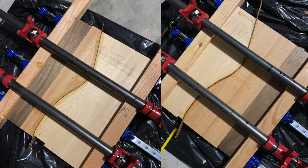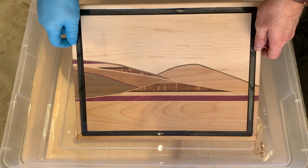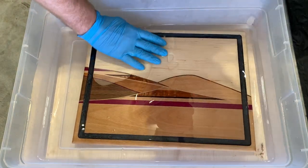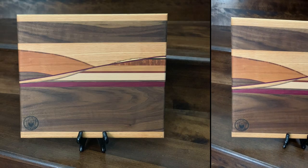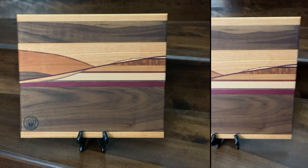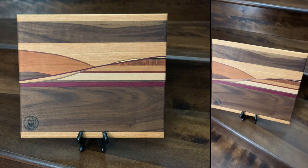Welcome to another Howdy's Quick Build. After seeing them on YouTube, I decided to try my own hand at a few of the woven cutting boards. This is where you stack two cutting boards on top of each other and use a bandsaw to cut identical curves. You then glue the alternating boards together with a thin accent piece of wood between them and repeat the process as many times as you want. It worked pretty well for some of the boards, and I even had a few that turned out really well, but a few of them had some small gaps in the creases. Since these gaps would ultimately catch food, they couldn't be used for cutting boards, so I turned them into clocks.